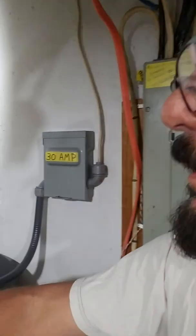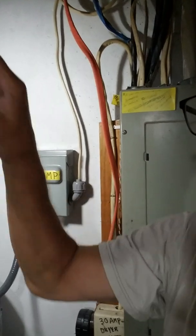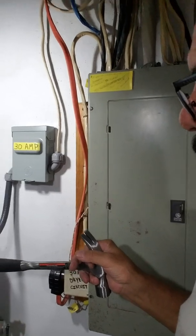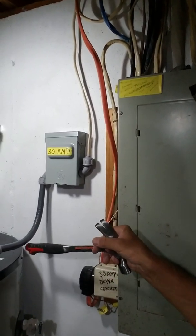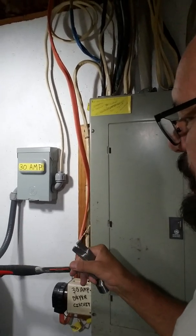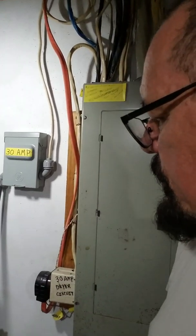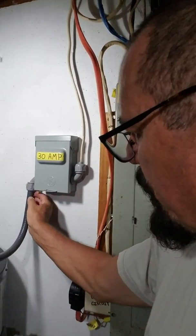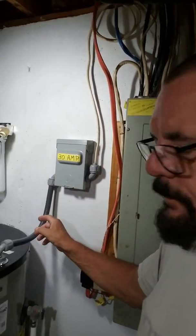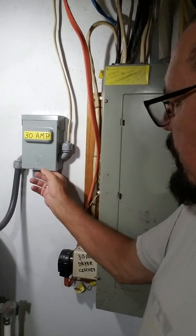What I did — and it's probably why I didn't bring you along — was install this emergency disconnect. It's very simple. My biggest problem was I took some Noalox, which is like a non-water-based Vaseline, to pull wires through these 90-degree turns. Number 10 wire is kind of a hassle pulling through 90s, but that worked out well enough.